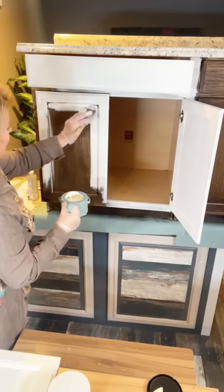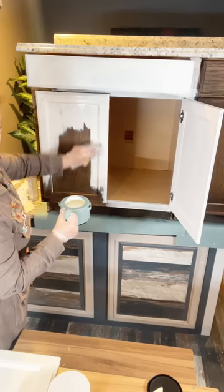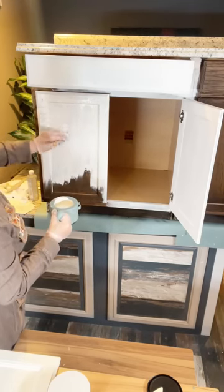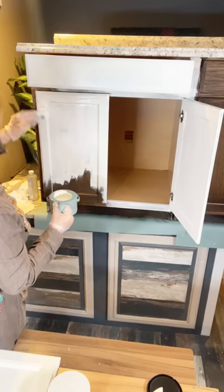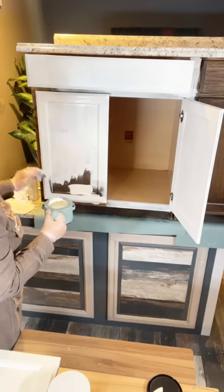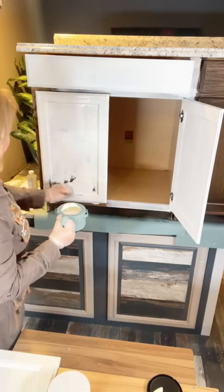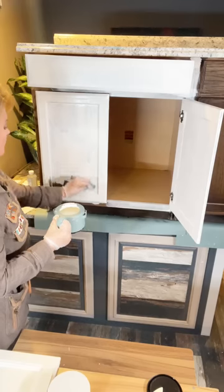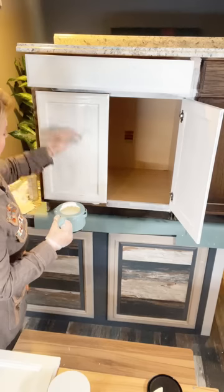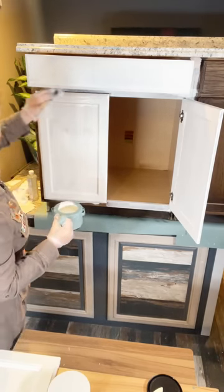Using my Syntec brush, I'm not being stingy with the paint — I'm brushing on first and then I'll come back and roll it. Notice I'm dipping several times back into my can and picking up more paint. I'm stabbing into the corners to get those deep areas. You can look at it and go, that's a mess — and that's okay. Get all the edges and run your brush over so you don't have any runs.